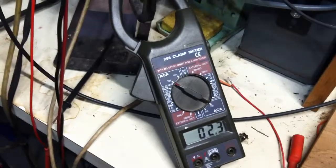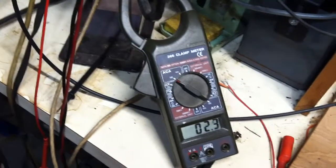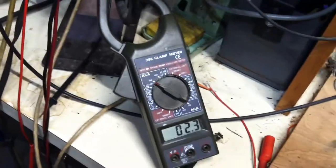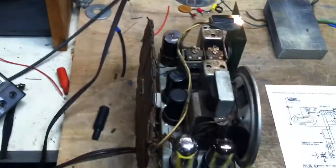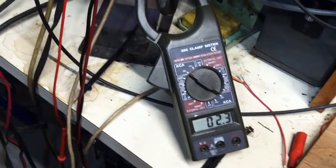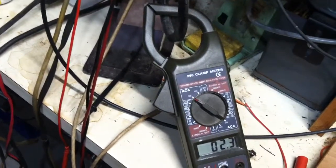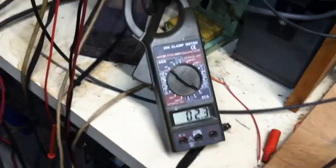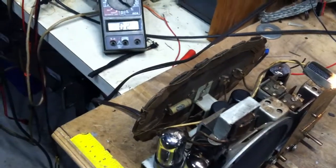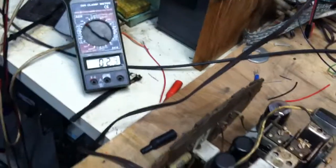This is a very useful thing to do — works really well. I think I paid like $13, 20 years ago for this little clamp meter. I use that whenever I fire up a radio, or really anything that's a relatively low current device and there's any question about it. I'll put it on the clamp meter and watch things as we're turning it on to make sure everything is working right, that we haven't got any shorts, or that it's drawing the current we would be expecting.